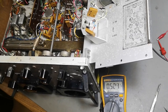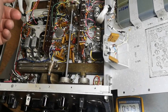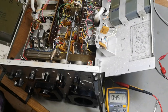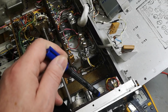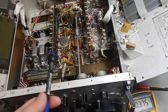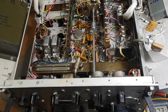So that's actually going to be a full stop, because the only thing on the power here is a power switch and the mains transformer. There is a leak inside the transformer — it's also looking a little brown, old, and rusty. The rust obviously went inside the transformer, and this is just the end of that story. Super sad — I was expecting to have a lot of fun changing the different capacitors and high voltage. But I can't do this with a leaky mains to chassis. I can power it using my isolation transformer, but this unit is definitely not safe to play with anymore due to the transformer.